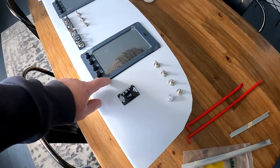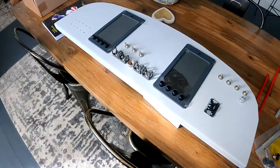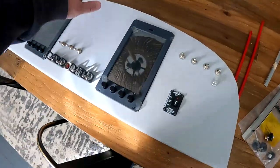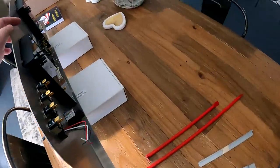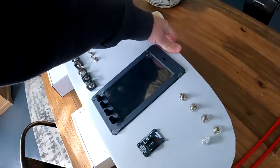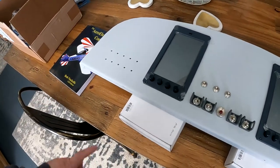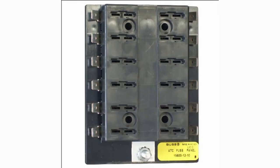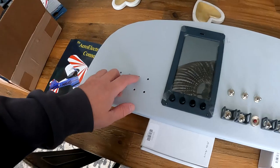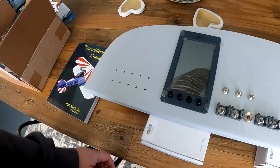If these MX-1 displays have one thing I'd like to see different, it's that the bezel overlap over the cutout edge is almost nothing, so it has to be cut very carefully — that's why I'm a big fan of the CNC route. Some of this may change once I get it in the airplane. I'm also going to mount this upright on a wooden base and wire up the back side so that when the new panel is created I can just transfer everything over. Since the circuit breaker holes won't be used, I'll go with the automotive fuse block — possibly accessible underneath the panel, or I may put a removable door on the front.